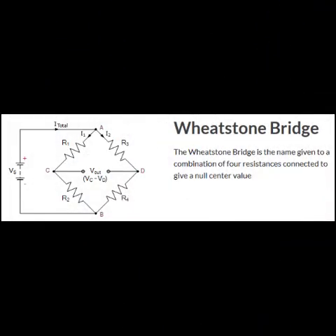At the core of many antenna analyzers lies a return loss bridge. An RLB is essentially the well-known Wheatstone bridge that many of us studied in basic electrical engineering courses during high school or university. As illustrated in the diagram, a balanced Wheatstone bridge delivers zero voltage across its arms when all resistors are equal.